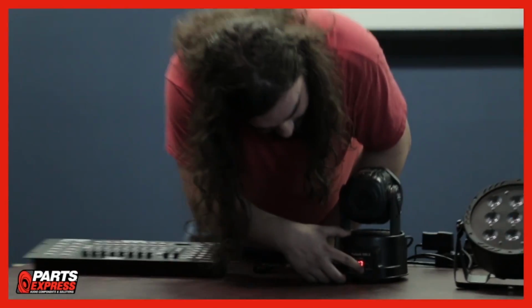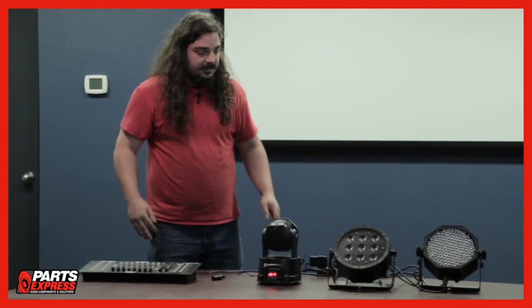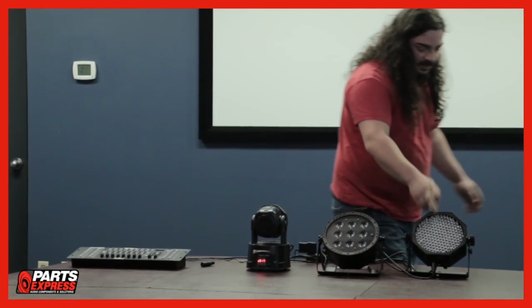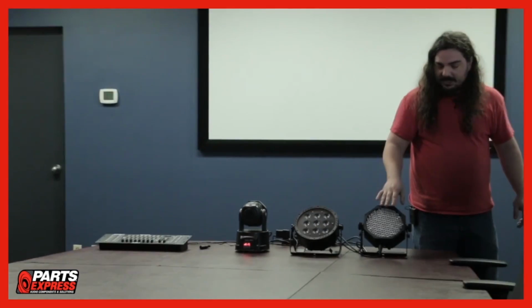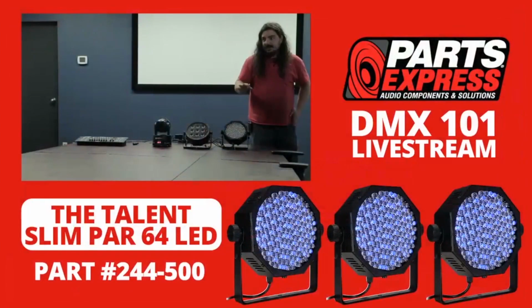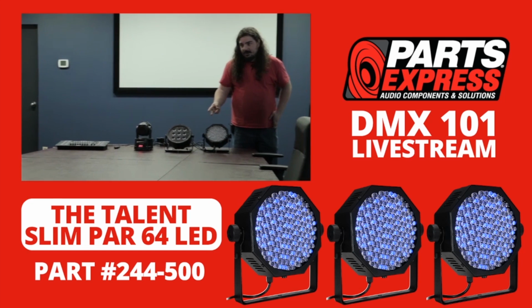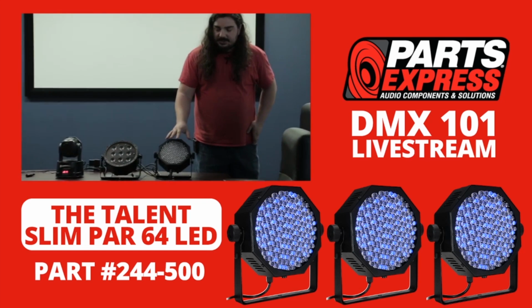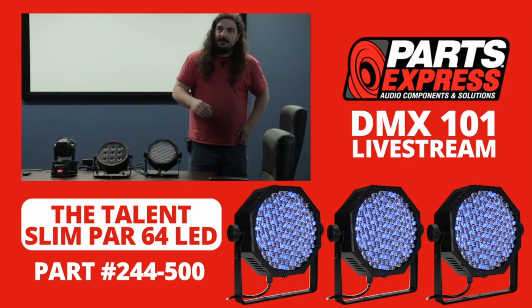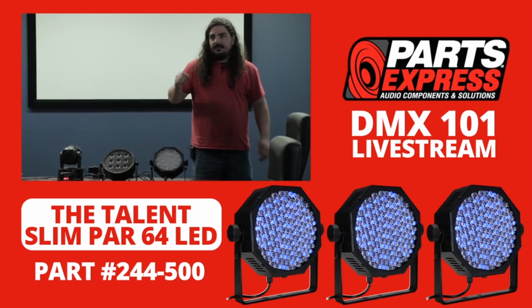It's always a good idea to keep the owner's manual with you. It's very, very useful on all of these lights. This one right here will do three different modes. It'll do three channel, which is just red, green, blue; five channel, which is red, green, blue with a master dimmer and a strobe; and seven channel, which is the same as five, but now it's added the macro like the other one has, and an auto.